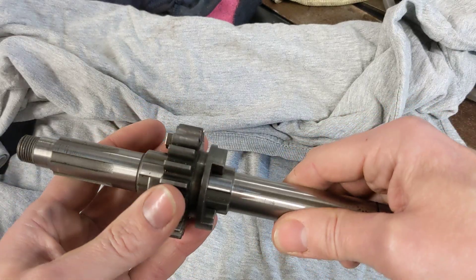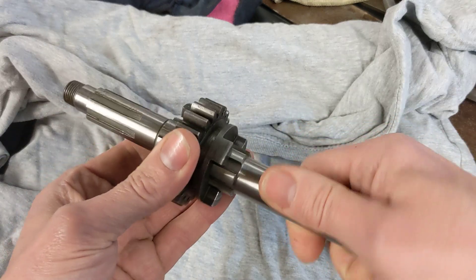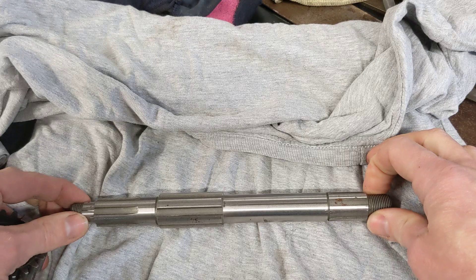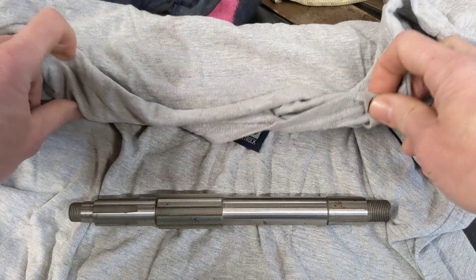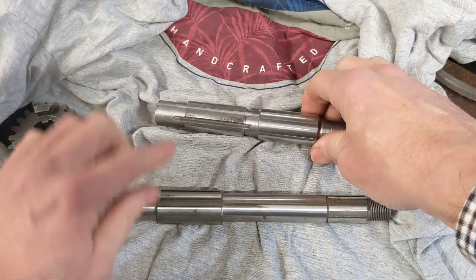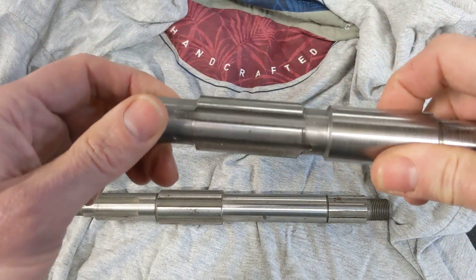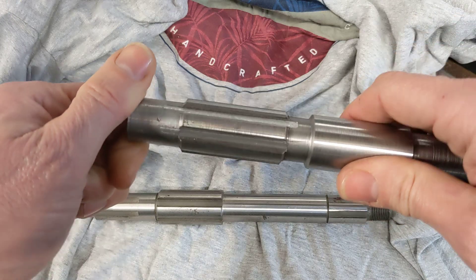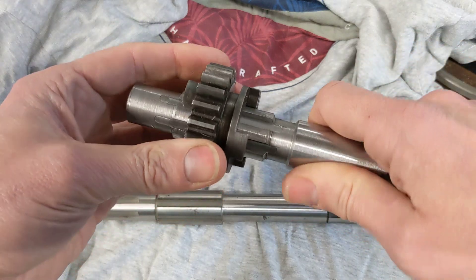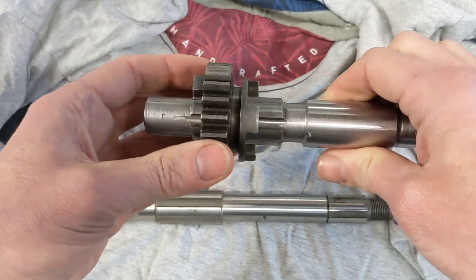There's no actual gears in the gearbox, just by swapping the dog — so I'm going to call it a gearbox to keep it simple. There's a bit of play even in brand new parts. My mate Matt, who you'll remember from some of the other videos, said he could do it, so I said go on then. He took this away, got a piece of old scrap steel, and he's done a cracking job cutting a spline on his CNC machine rather than broaching it. When I put the parts together there's actually less play in Matt's spline than there is on the original one, so I'm really chuffed with that.